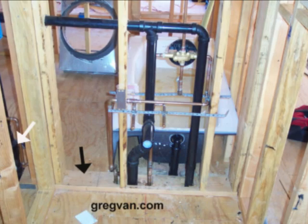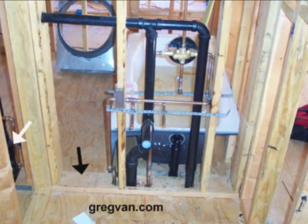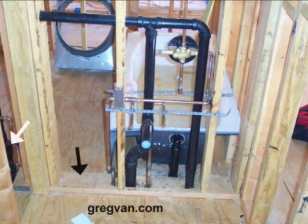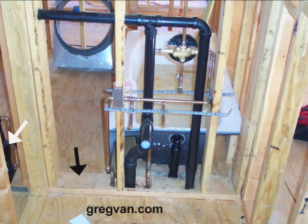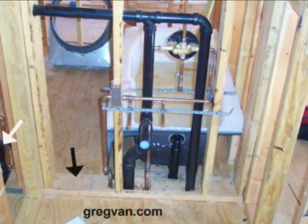Because once your pipe is about 3.5 inches and then you add the fitting going over the pipe, you're already over — it'd be about 4 inches. So you'd be sticking out of the wall, and the drywaller would have a problem with that.